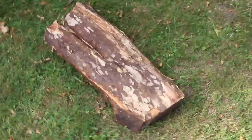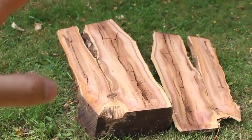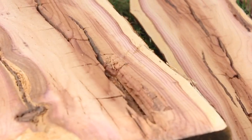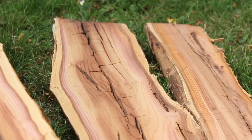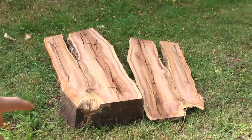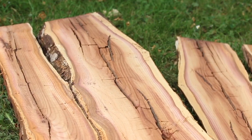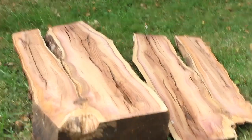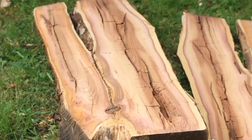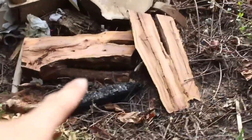I just cut the first slab — let's open it up. The colour is fantastic, however this is not usable unfortunately because there are huge cracks all the way down. The wood is actually too dry, which I had a feeling about before I milled this, because the guy that gave them to me had them sitting in his garage for many years. Sadly this will be firewood. I'm not really a resin guy so I won't be filling those cracks with resin. The colour is fantastic, but it is so brittle — it literally crumbles in your hands. Even if you filled it with resin, I don't think it would hold up.